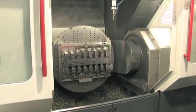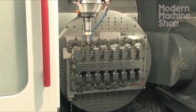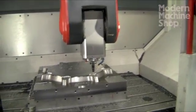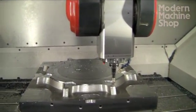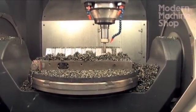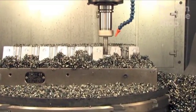When you can spin the part, the effective travels are bigger than they appear — it's a huge advantage. In a tilting head machine there seems to be more vibration than with the straight spindle of a trunnion style machine. With the straight spindle, the trunnion style machine is capable of a bigger cut.